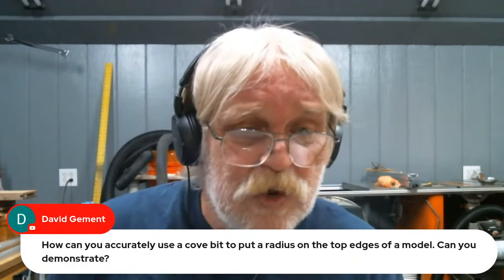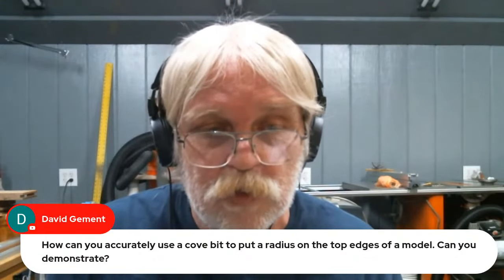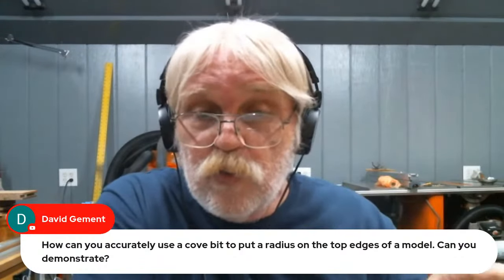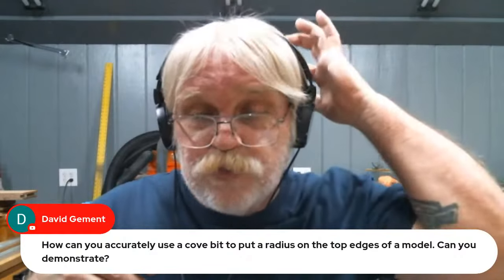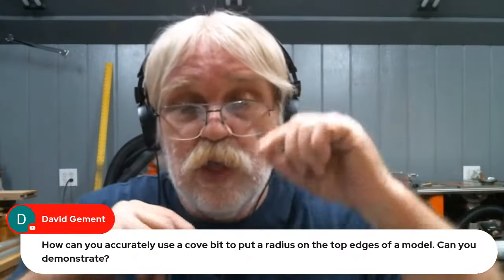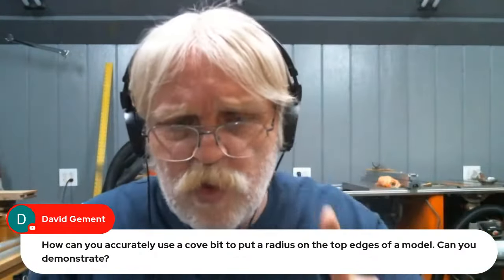David Donaldson asks: can you recommend offset settings when V-carving raised letter text? It would be different depending on how tall the text is. It also depends on the diameter of the bits you're going to use for clearance. If you're leaving raised text, you've got the text height plus an offset for the clearance passes — unless you're using the V-bit for your clearance. You draw your text, convert it to curves, then go letter by letter and offset outward. I'd demonstrate in Aspire, but let me show something about composite models that a lot of people don't know about.